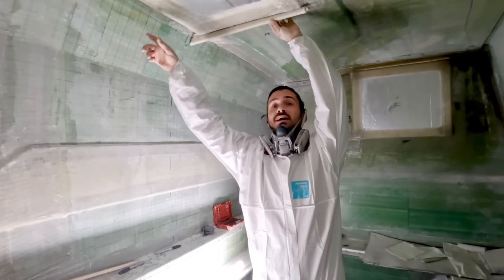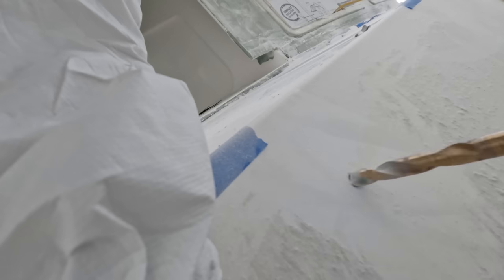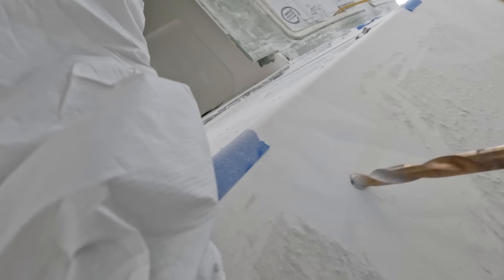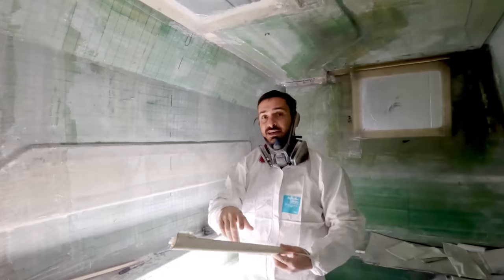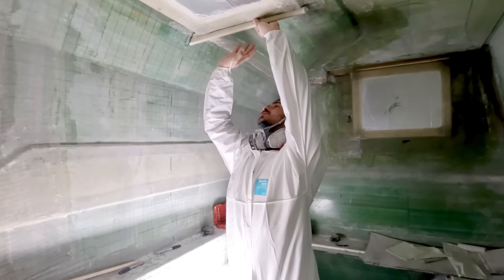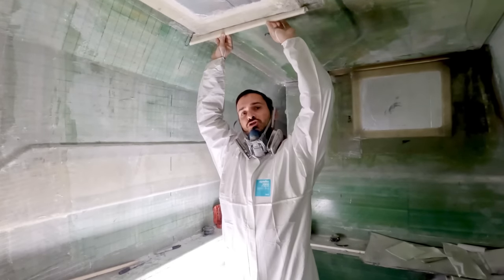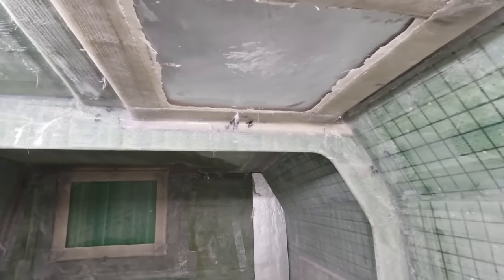So here's our hatch opening. It goes in there. And then what it allows me to do is drill drain holes in this area of the hatch, either area there, which will drain into here, and then go overboard. What I've done is figured out where this is going to go. And again, we're going to do the same thing. We're hiding that in the bulkhead itself. It's going to become part of the bulkhead.